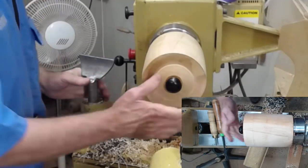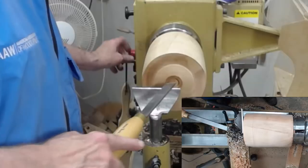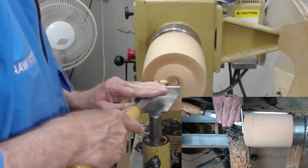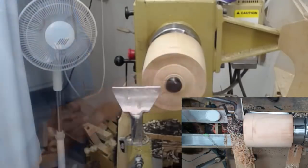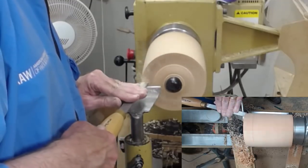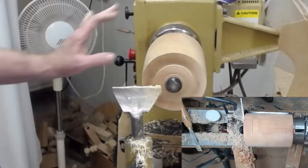I'm really liking that — very nice polished knob. Now I need to clean off this surface right here; it's got wax on it. I'm going to use my skew in negative rake scraper mode because it's convenient and I just need to get rid of that wax. I'm not going to use wet abrasive on this because I don't want to get wax anywhere near the glue line. Going back to the skew just to clean up that edge a little bit — you can see what tiny little shavings I'm getting with a skew as a scraper.